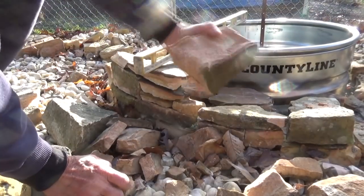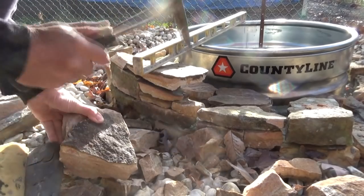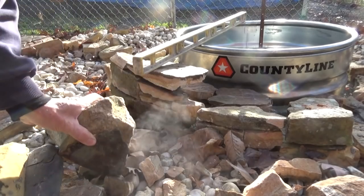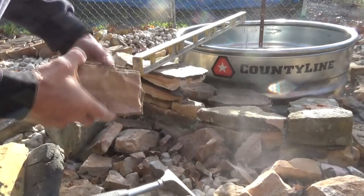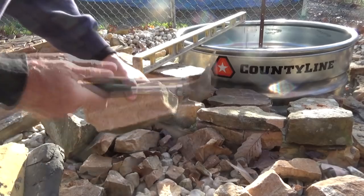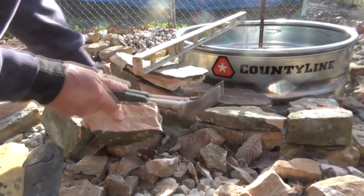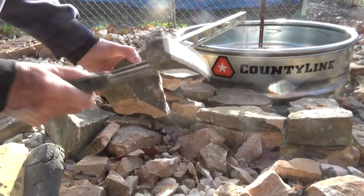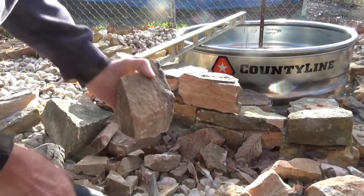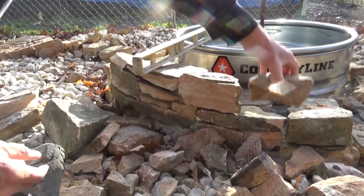I'm taking my best stones. This stone is like a sandstone — it comes from Scranton, Pennsylvania, from a quarry called Godino's Quarry. I'm always planning my next shot. See, it's easy to kind of chip and face. Some of the stones I can break and make them the way I want. I'm getting this even with the top of that — that's why I'm using this level here.